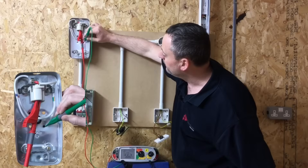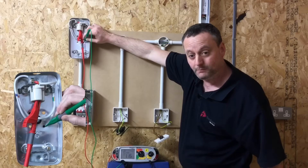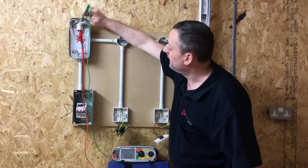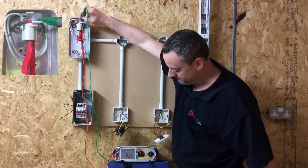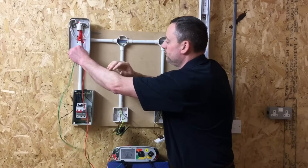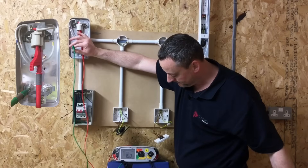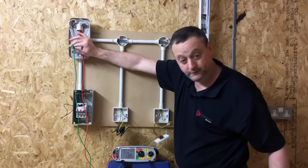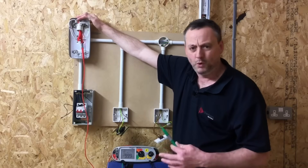We're now onto the actual metalwork. I'm probing onto the back of the box — on to the actual metalwork — and I've got a reading of 1.14 onto the chassis. You might have to scratch it a little bit to get a reading. I'm again getting 1.14, and then on the screw at the bottom I pressed nice and firm and got a reading of approximately 1.35.